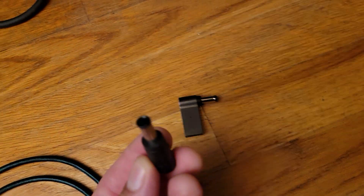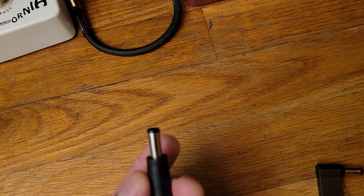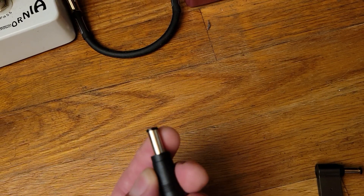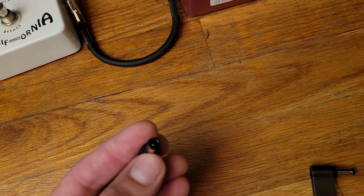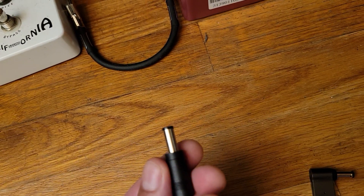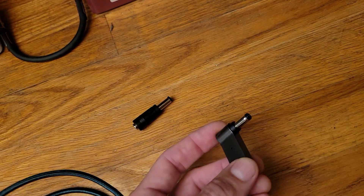This is the style that has a little tiny pin in the middle. That pin is actually not carrying the voltage — the negative is on the outside and the positive is on the inside of the barrel. So if you're trying to check for voltage with your voltmeter, remember to check that. It's easy enough to verify you're getting 20 volts.